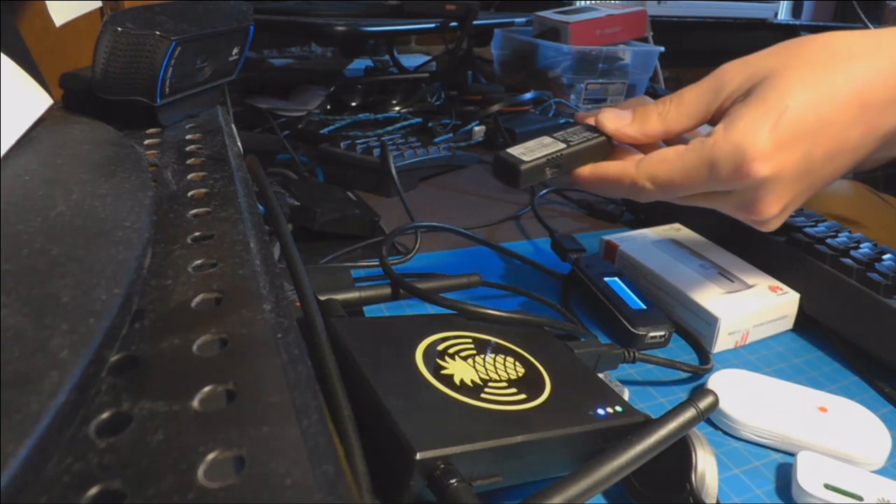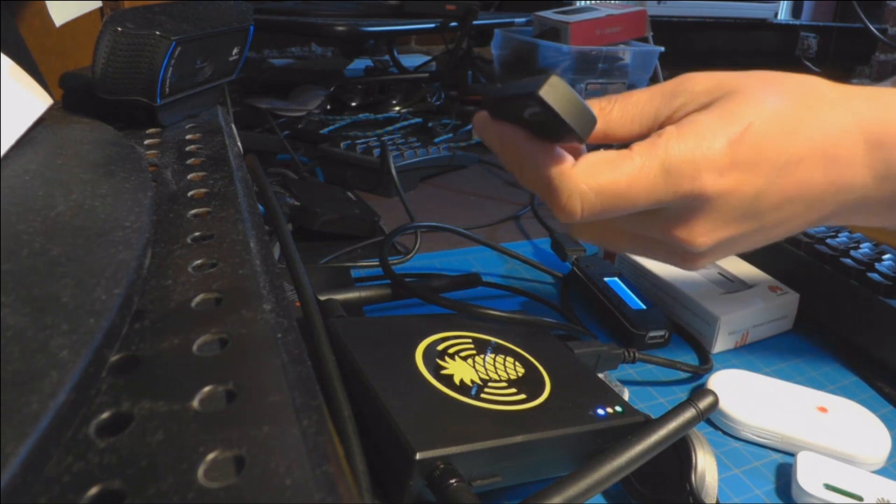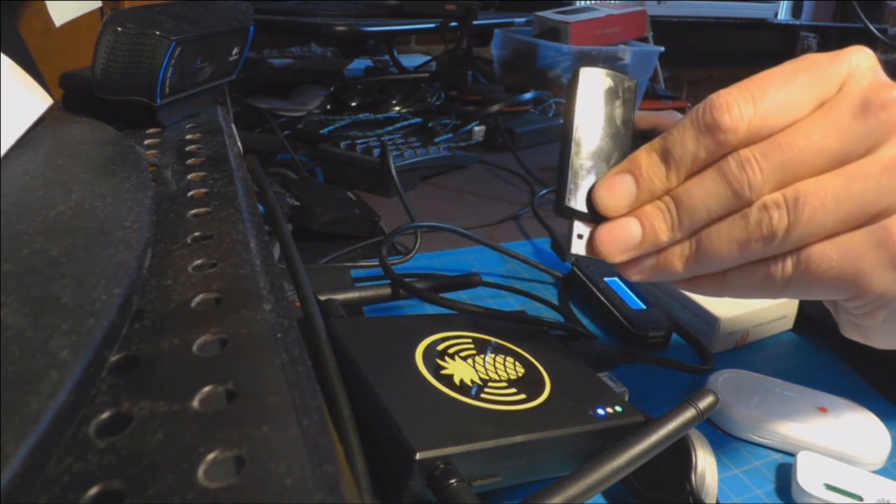As opposed to what we're more used to — say, this Novatel MC760, a very popular modem that just shows up after you USB mode-switch it as a serial device. There's nothing wrong with that, and the core of the Pineapple can speak to those serial devices no problem. However, there is overhead in maintaining connection quality, so you have to manually do redials and there are keep-alive scripts for that. In my experience, I have had fantastic results with managed modems.